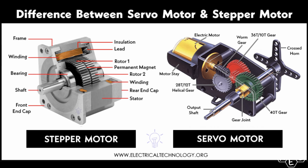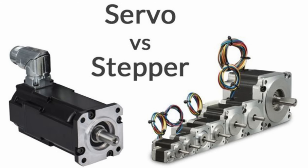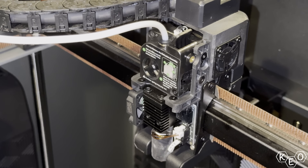From my limited research, it seems like the servo motor likely has more of an upside than the stepper motor. Stepper motors are cheap, readily available, simple, and they work — kind of the 'if it's not broke, don't fix it' sort of thing. So why would we want a servo? From what I've read, it's really just a matter of a position sensor — typically a rotary encoder to keep track of the motor's position. This allows for closed-loop strategies to be employed during operation, making for more exact movements. In the case of the Creality K2 using servo stepper motors, they've probably got the traditional stepper motor with a position sensor added, getting the benefit of a cheaper motor that still has closed-loop control.